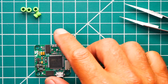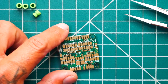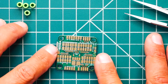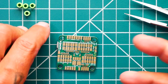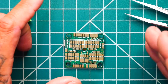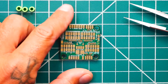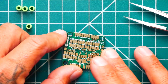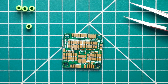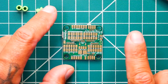Check this out — if I flip this board over, all of the solder pads are on one side. Why would you do that? Well, Dominic Clifton put all the solder pads on one side because if you mount your board this way — which is how it's designed — you don't have to take your quad apart to do anything. Your wire lengths, you can get them perfect every time. This is really awesome.